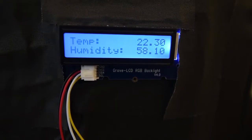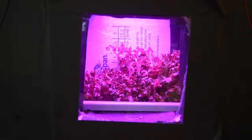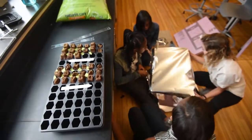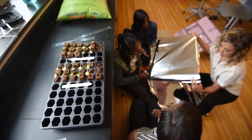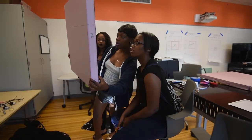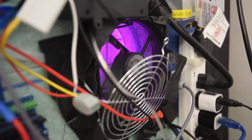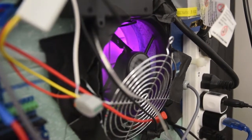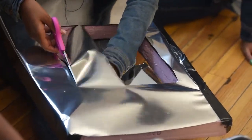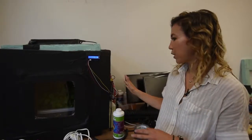It's climate controlled with computer programming. In this one we use a thing called an Arduino, which is basically a microprocessor — a mini computer kind of. In the class we teach our students how to do basic coding and then how to code for what kind of temperature and climate we want inside of the computer. We have lights connected to the Arduino, a fan connected, a temperature and humidity sensor, and an LCD screen to keep track of what we're doing.